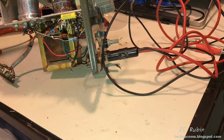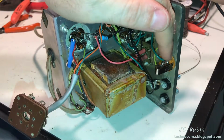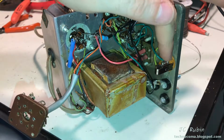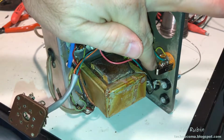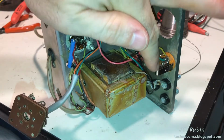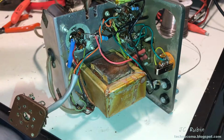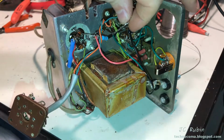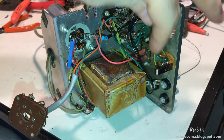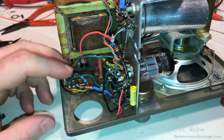I'm going to wire it up now. So I've got the star ground wire coming into the jack here, and then I have that secondary yellow cable here, which is the shorting cable when the plug is disconnected. Now all I need is the final signal cable, and that is basically this connection coming off these 2 resistors, which I'm going to redo to bring those resistors over to the jack where there's actually room. And there we go. All the connections on the jack are done.